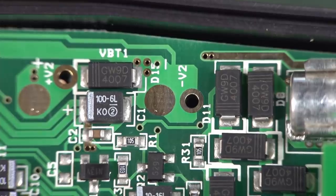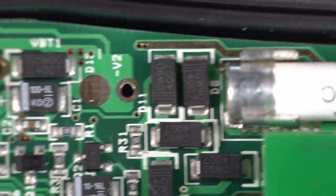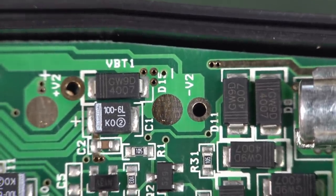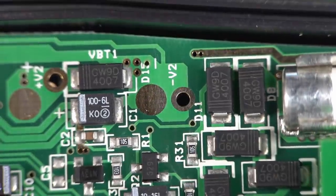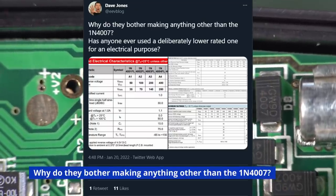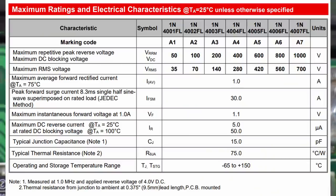The reason they're not using a 4001 is because they probably use the 4007 for protection somewhere else and are just reusing that BOM part. From a bill of materials point of view, it doesn't make sense to have high voltage parts somewhere else and then use the lower voltage 4001 across the battery. They're so cheap, you wouldn't bother having a different bill of materials item just to put across the battery. Of course, the battery only needs low voltage, so the 4001 would work a treat.